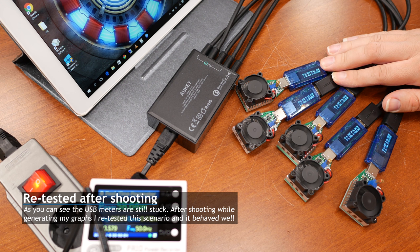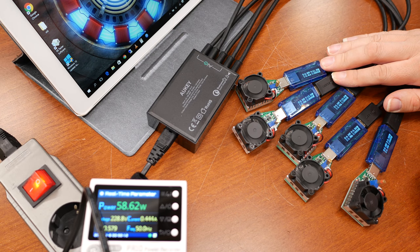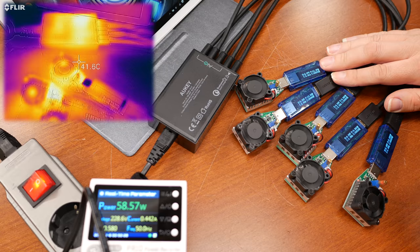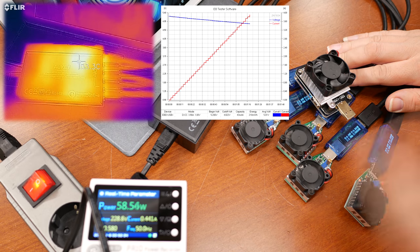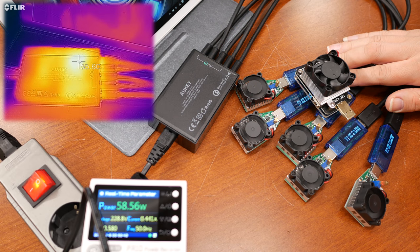And that's it for part of this video. I'll leave it running for about 10 minutes with this load, with the 60 watt load, or 50 probably in reality. And then I'll do a thermal video, and also make sure to check out my blog post, which will be in the description, which will have some graphs I generate using my ebd-usb. Of a single load, the standard 3x5 volts 2 amp test, and then the quick charge tests and fully loaded to see how it behaves.